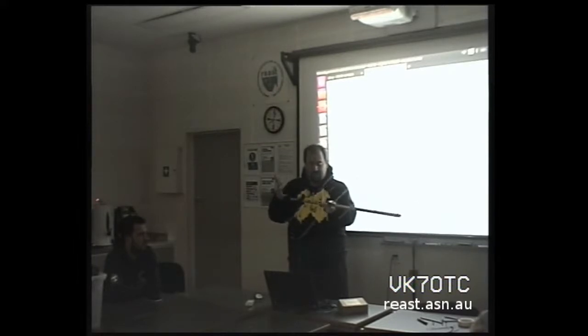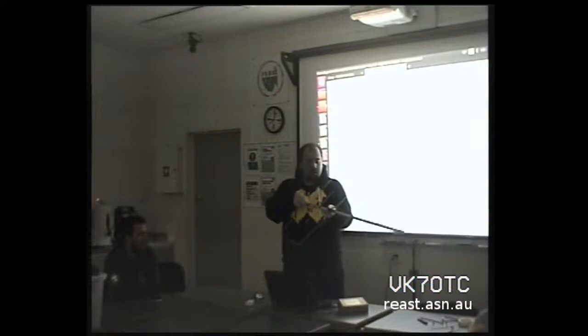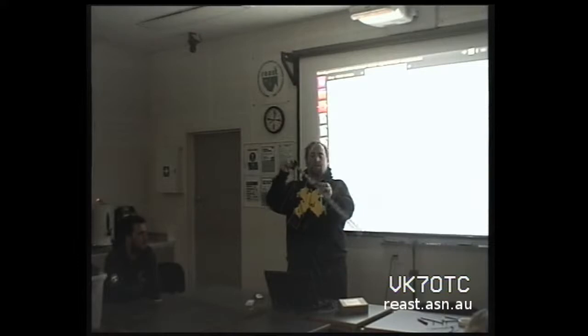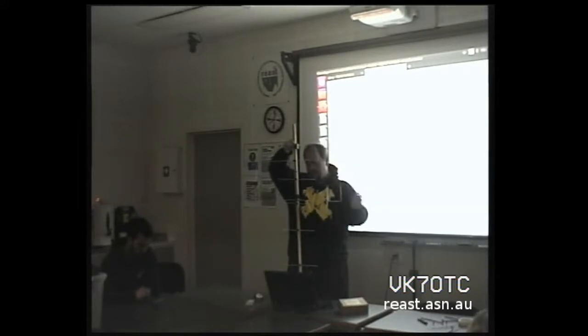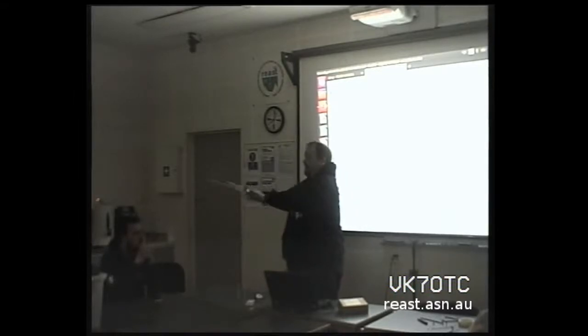One of the fun things is you can't really get clips for the 3 millimetre antenna. They tend to only go down to 4 mil. So in this prototype, I've actually used just electrical tape to add a bit of space around the elements to clip down onto. Plenty of hot glue. The brass attachments onto the aluminium here are made out of electrical terminal blocks, and the aluminium is 3mm TIG welding aluminium. So I'll pass that around again.